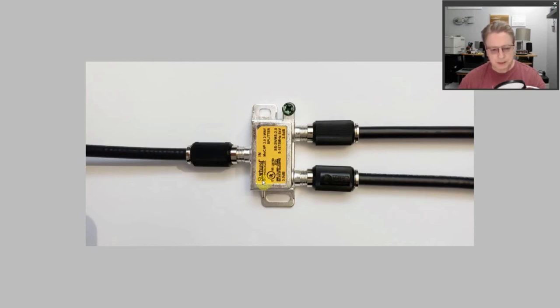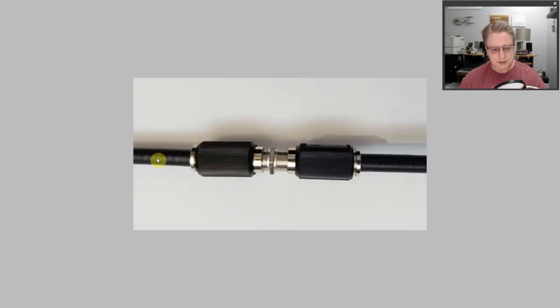So if you have a splitter there, you're going to want to make sure that you take that splitter with you — you're going to need it possibly at your current or new location. What you're going to do is take the coax coming from the ONT and connect it to the coax going to the rest of the house, joining them together with a little RF coax connector. You can get these fairly cheap, only four to eight dollars depending on where you get them. The most important part is to make sure they pass at least two gigahertz of signal frequency, and even better is to get three gigahertz ones, which don't really cost noticeably more.